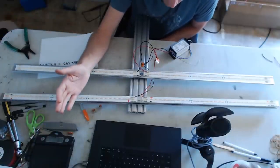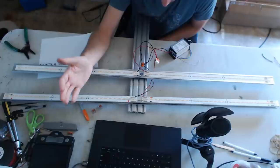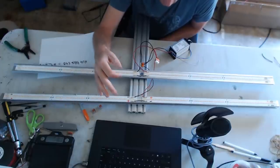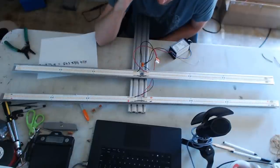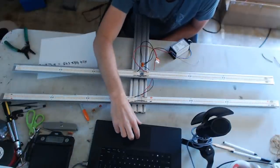If you get an HLG 185 — basically the equivalent of a 200-watt driver — that might work really well for a four-strip setup, giving you more bang for your buck. Otherwise, an HLG 320-1400B runs four strips in single series perfectly — so it's up to you.